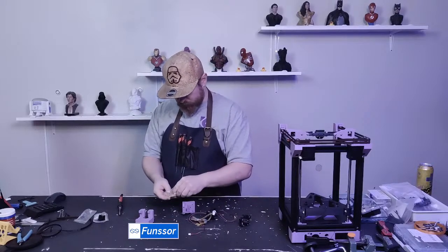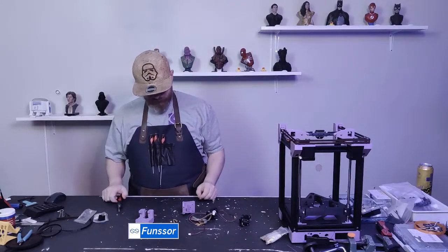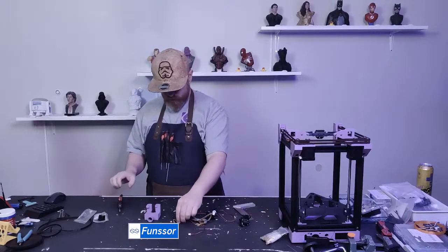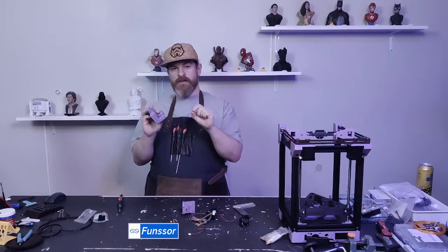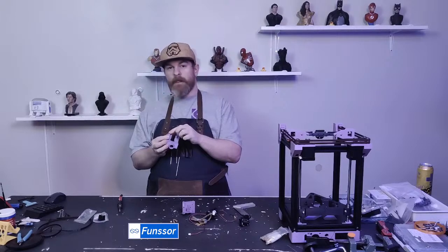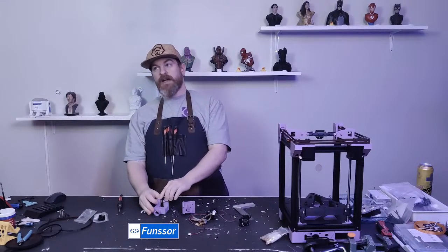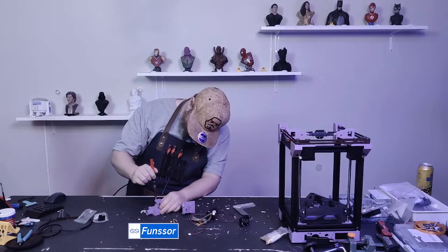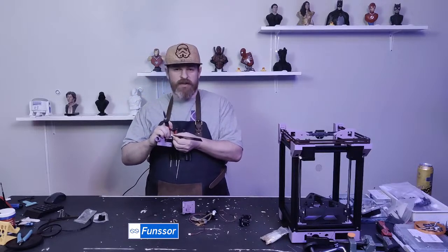Let's just grab a bunch of heat sets. My trusty tool. So here's a good test for you. If you're using heat sets on Rook parts, and you have the 3x4x5, they should just fit into these holes perfectly. They shouldn't fall out, but they should also not move, because the hole is 0.05 bigger than the heat set. And if you haven't done this before, just remember, do not put any tension or strain on your heat set. Just let it go in by itself.